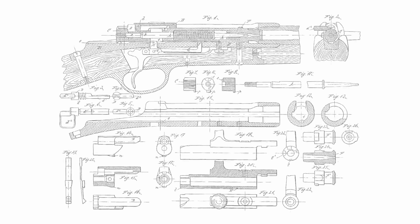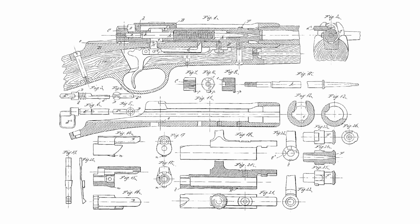Now, the Mauser Koka, as it's often called, didn't just keep the doors open at Oberndorf. It was also a significant evolution of the 1871. Again, I don't have one here, but let's just list off some of the changes that came before our gun today. The cocking piece was redesigned, allowing the mass of the cocking piece to aid in striking down on that primer. I'll show you that in a moment.